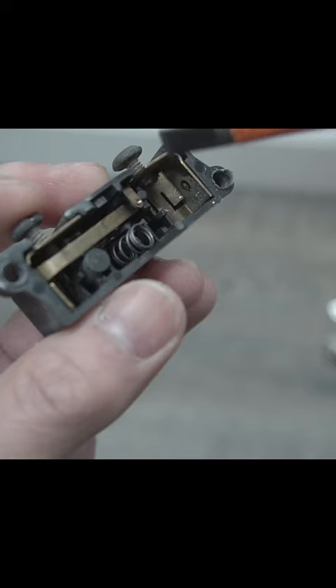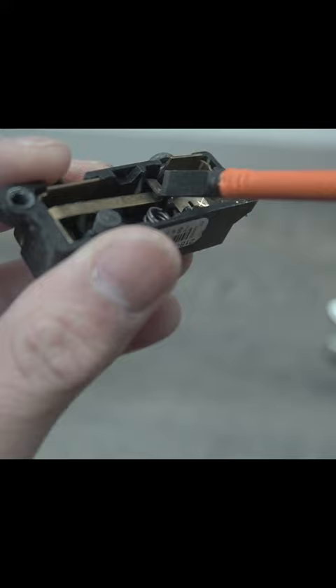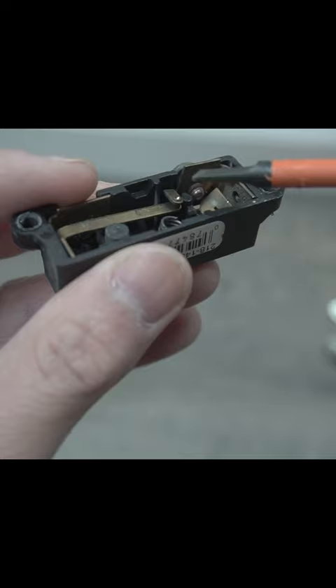The internals of your switch is what gets worn out. Switches get used thousands of times over their lifetime. Carbon will start building up inside, there's going to be a gap somewhere, and it's going to start to arc and spark, and obviously that heat will start to melt all the conductive parts in there. Just replace the whole thing.